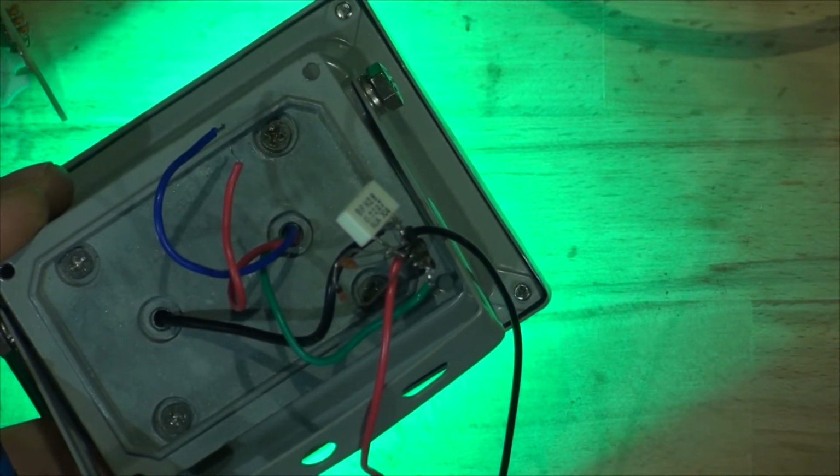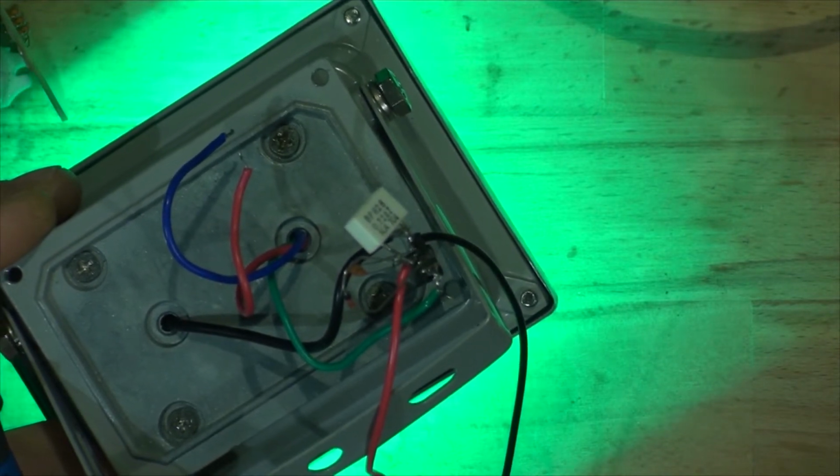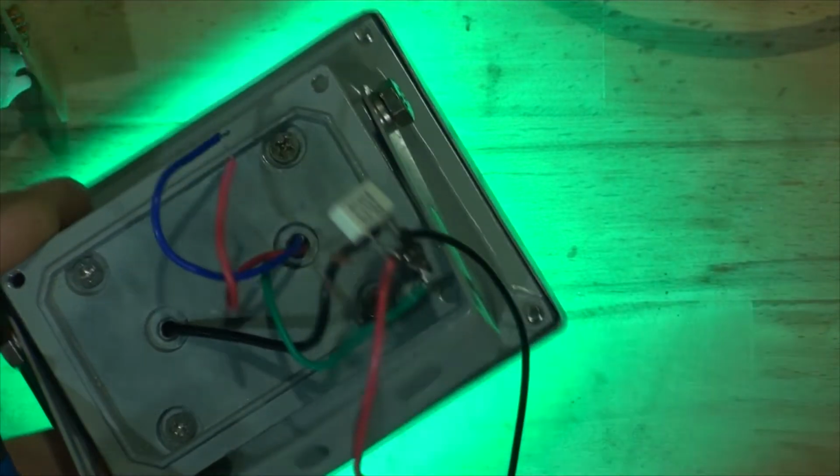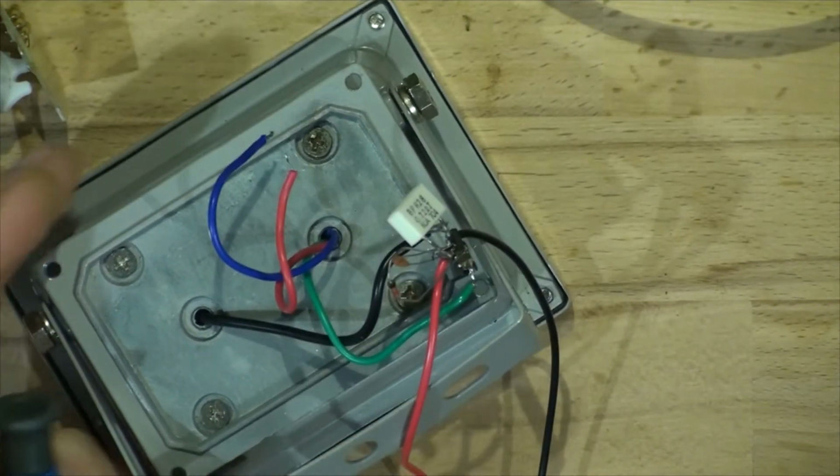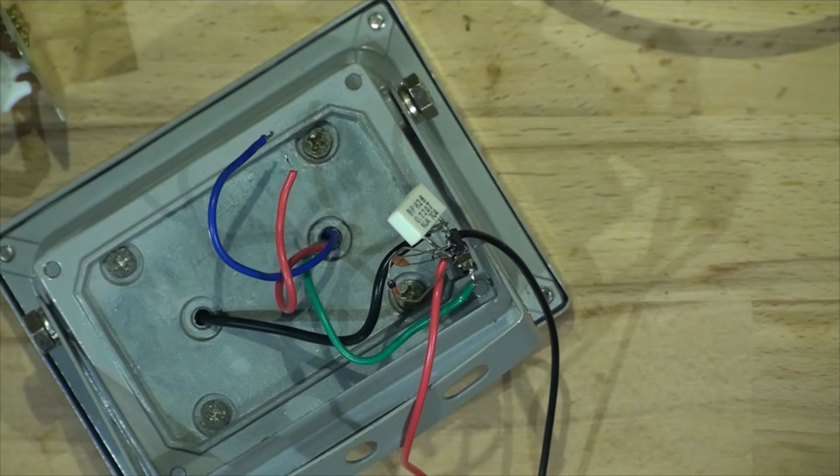The specs for the LED suggest 320 milliamps. So I'm just 40 milliamps under, which I'd like to keep that way because, you know, if you're driving it to its max, it's going to burn out faster. I'd rather have it just slightly dimmer, which is not going to be noticeable by much, but to make sure that it's going to last a while.